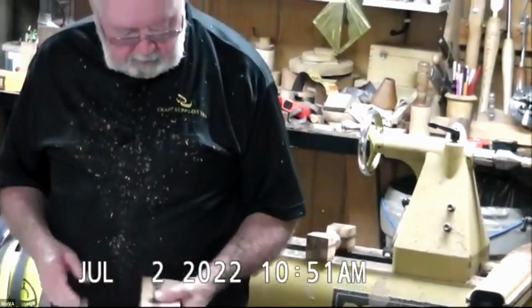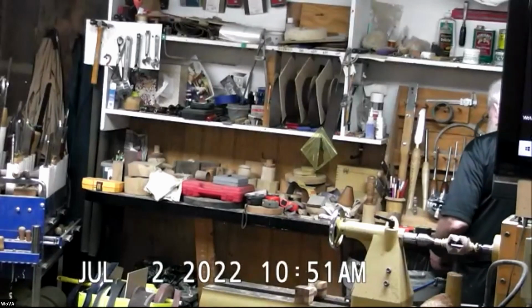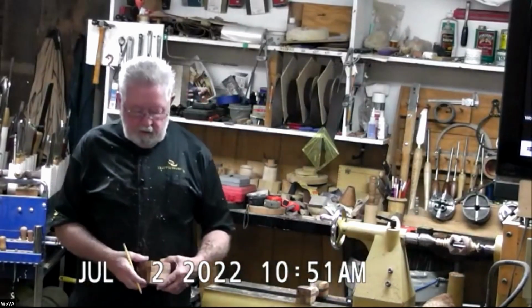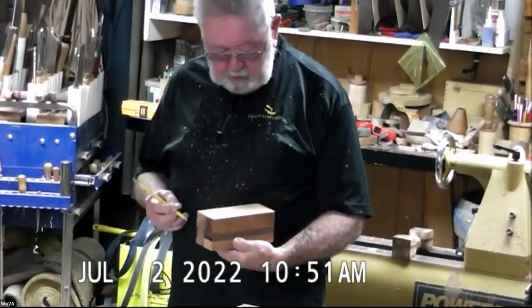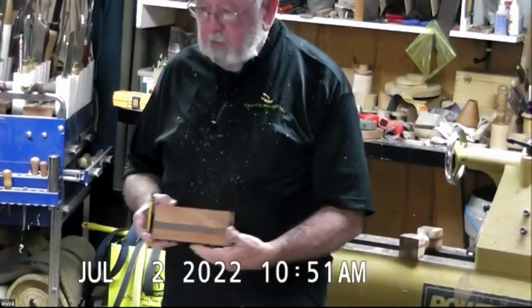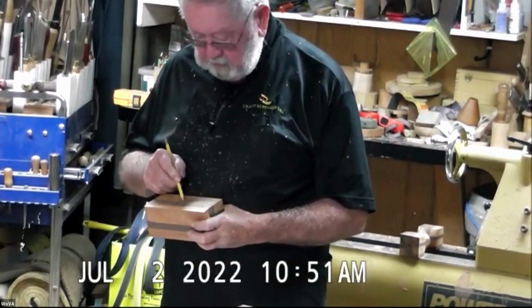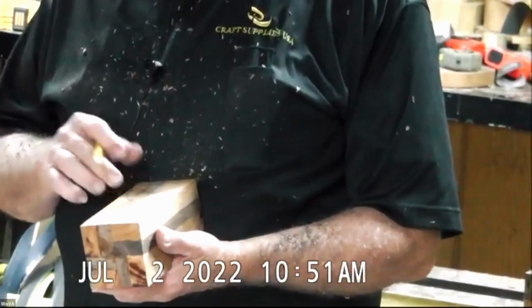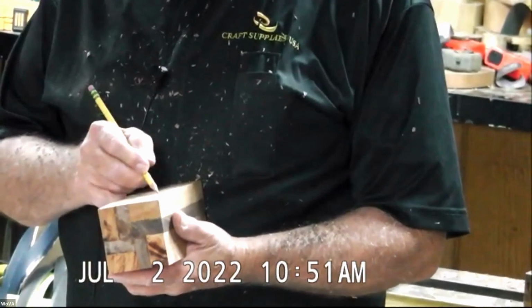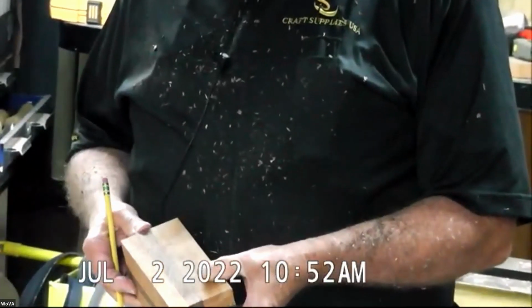And this block here, since it's a short block, I'm going to go towards my cup. But once I lay this off, take my 1/4 inch here, 1/4 inch here. That's close to center. I want room to work on both sides. So I'll make a cut like this. Something like that. And that gives me room then, after I do this, to come in here. At the same time, I got room to do something in here on both ends. Whatever you want to do.